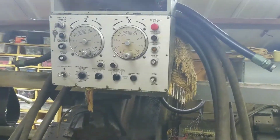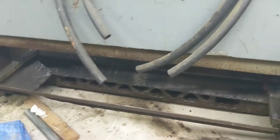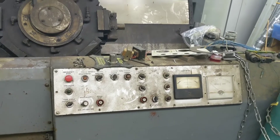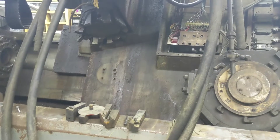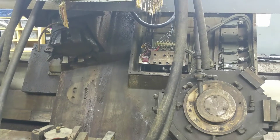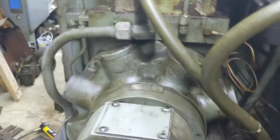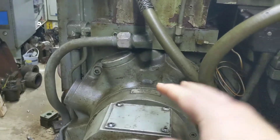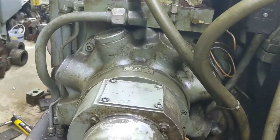I don't know what we're going to use for a motherboard yet. But it's moved to where it's going to be. We'll start tearing into it — we've got to get the ways oiled and move some stuff around so we can get at the X-axis to figure out how we're going to mount a servo back there. The Z-axis I think is going to be pretty straightforward. Once we remove the hydraulic servo, the end of the ball screw is right behind it, so we should be able to do a gear reduction or direct couple depending on what we have for a servo.